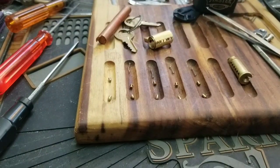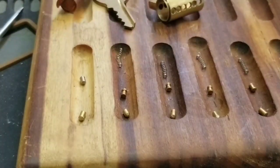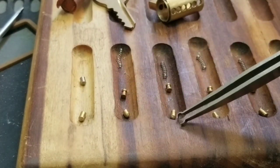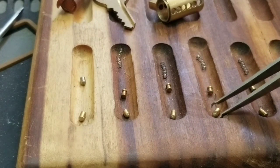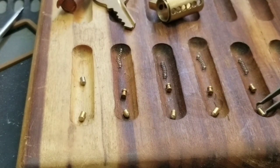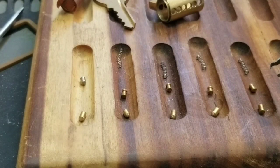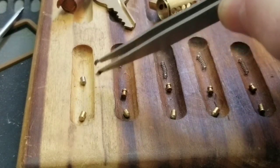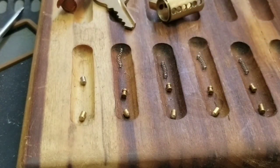Let's see what's in the top. Here we go — there's one. It looks like it could be slight serrations in there. I've got to fight the spring. Two — okay, we got a spool, we definitely got a spool. Three — a spool, spool. Another steel spring. Another spool — I got lucky on this pick. And another spool. Springs are all the same. One is still stuck in there. Nothing done to the core. Here's the core — nothing done to it. We have standard, standard, standard — all standards except for the last one, which I believe I added. The rest — the number one top end is standard and the rest are all spools.